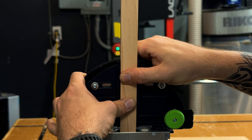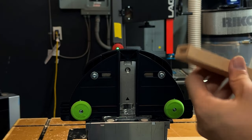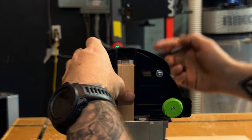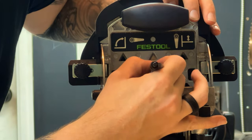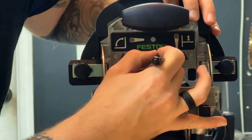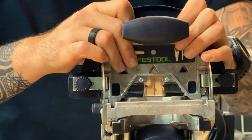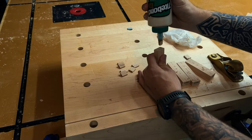All of the cross pieces get small dominoes. Not for strength, it's just for lining everything up. I just lock my domino into the Moxon vise and go to town, being careful to reference the same side on both ends. I used to use wood glue with a dab of CA glue. This might cost a little bit more, but it helps me line everything up much better.